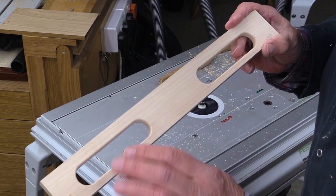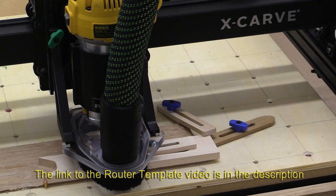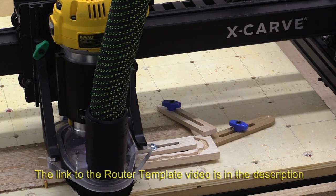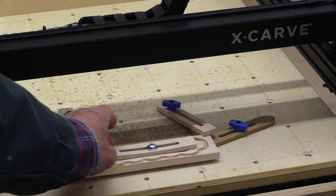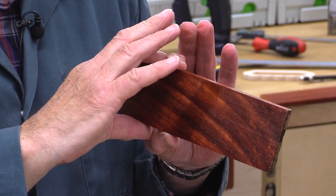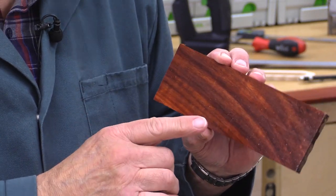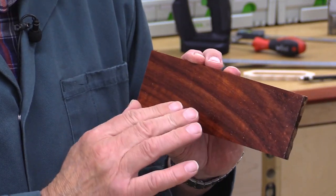It may be difficult to see, but that is nice and smooth — just what I wanted. So it's back to CNC now. You'll notice I've actually held the centre piece down. I've cut everything to size in the width direction and I'm now cutting everything to length. But before cutting it to length, I've put a coat of Osmo on. The reason is simple: I want to be able to do some of the detailed work without worrying about glue staining the wood too much.